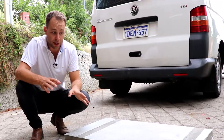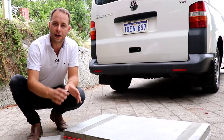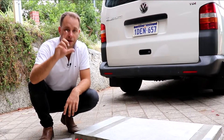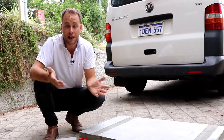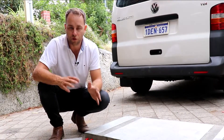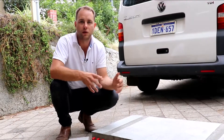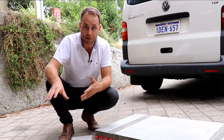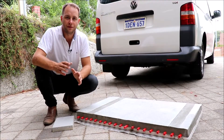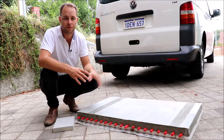With screeds, even though we have the standard type and our own custom type, we can actually adjust the level or thickness of the insulation and the height of the screed to suit any project. So we can do custom screeds, meaning you're not locked into either one solution from one manufacturer or something else from another. There's a lot of flexibility. Generally, the more insulation you have, the better the thermal performance, as there is less energy leaking from the floor system.